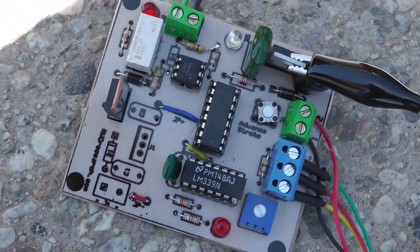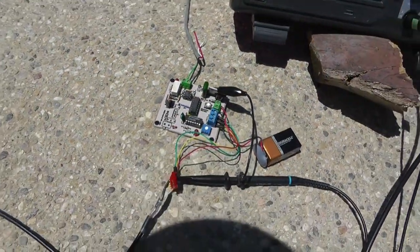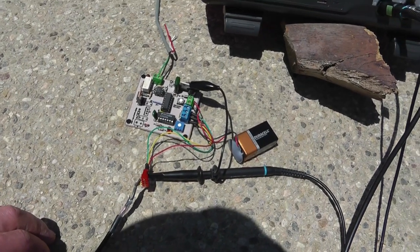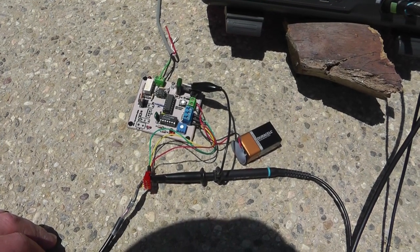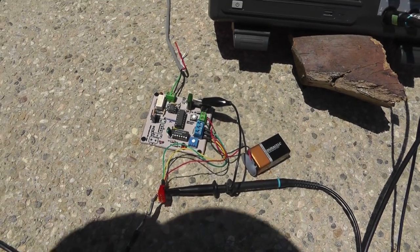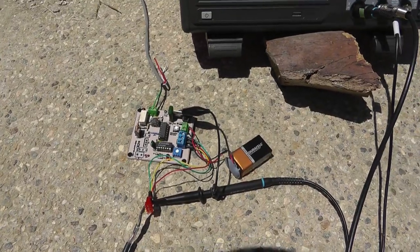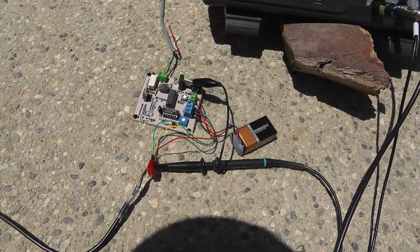And I'll give this circuit away, show you what it does, show you how it works. But basically it just kills the switch on the engine for every other revolution to get rid of the waste spark. I didn't want to do this mechanically. I wanted to do this electrically, so I didn't have to modify anything. So this was an easy fix for a general solution like this, instead of modifying it mechanically. Now I did create another version of this, and I'll show you what it did, but I had lots of problems, and I'll explain that later.